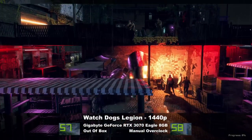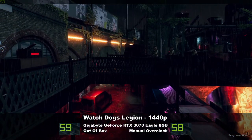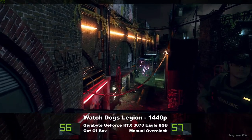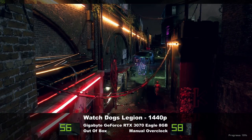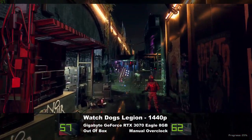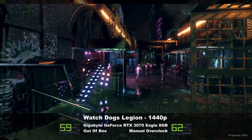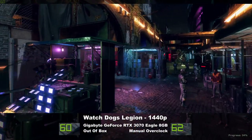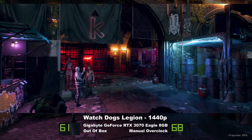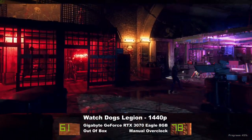So like I said, stock clocks for the Founder's card are 1.5 gigahertz, and I just popped right past 2 gigahertz without even trying very hard. That's a lot more than I thought I'd get. Remember, this is the budget priced model from Gigabyte. This isn't even one of their fancy ones. It's not even the OC model of the Eagle card, which is a slightly better binned one that comes with a higher overclock out of the box, but otherwise identical. This is a base model, one of the cheapest 3070s you can buy. And like I said in my review, the heatsink felt remarkably light by today's standards, so I was a bit worried about keeping temperatures under control under an overclock. But here we are.